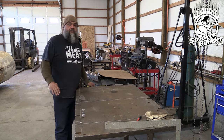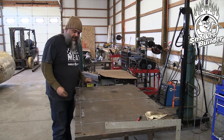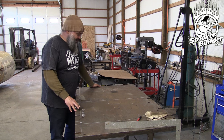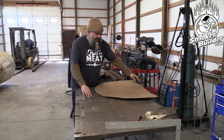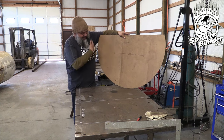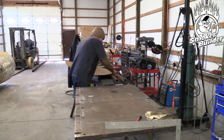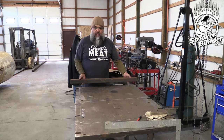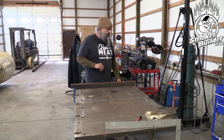So I have a table here — it's not my most ideal size, but it's empty and we're going to use it today. I have a couple of tools here: I have a cardboard piece of CAD here, which is just the profile of our outside diameter — 41 inches of our propane tank. I have some tubing cut long, which is going to allow me to play with some shapes as I'm trying to figure out what I'm making. And I got my tape measure, which is going to tell me where I need to be time and time again.